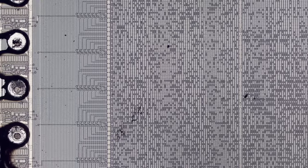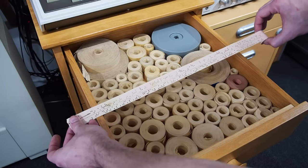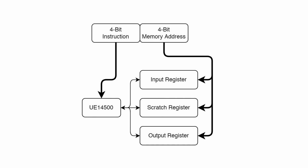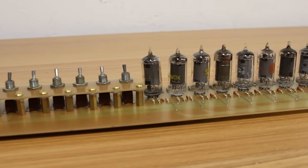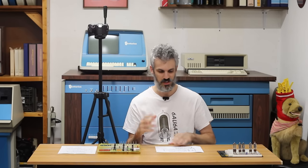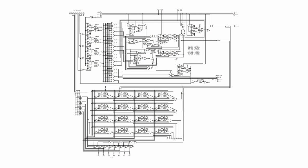What we learned is that the MC14500 has a ton of transistors — Ken estimated about 500, which compared to other microprocessors of the era is incredibly low, but compared to the other ICs on this board is massive. Something like one of these 7400 series ICs will have just a small fraction of that number — except for this big ROM up here, which is impossible to recreate out of vacuum tubes. So instead we're going to recreate that out of paper tape. The paper tape is just eight bits wide, and it just so happens this ROM puts out eight bits and our instruction word is eight bits — everything lined up perfectly.